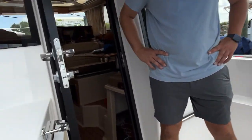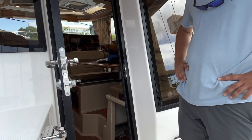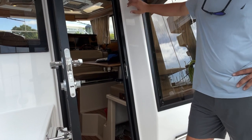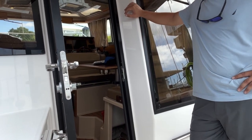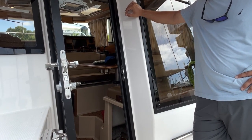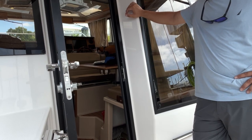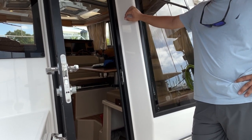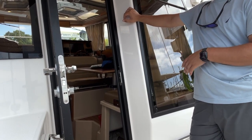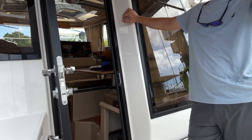And second refrigerator here. Okay. If the boat's in the water and not sitting on a lift, even if it's connected to shore power, I would assume normally I would turn all the DC masters off, everything? Yeah, I recommend turning everything off that you're not using, but definitely have the battery charger on to charge your batteries. But yeah, I always recommend turning everything off you're not using.